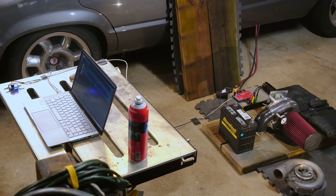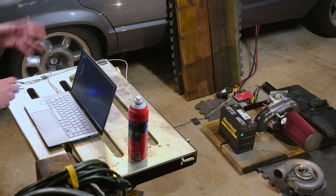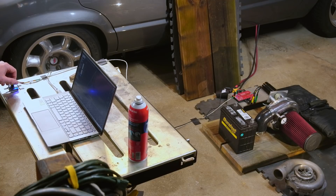So we're now at 260 motor amps, 360 absolute amps, 200 battery current amps max. Let's go to real-time data and try her again. I love the fact that it threw a fault code instead of blowing up — that's a step in the right direction. Last time I tried this I almost burned my house down.